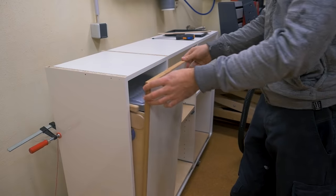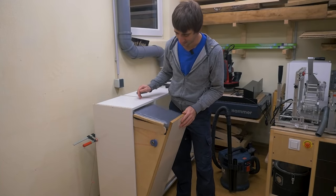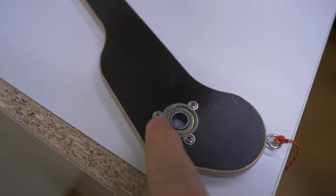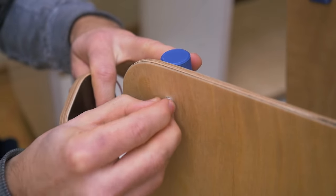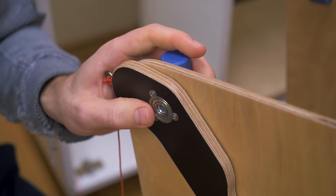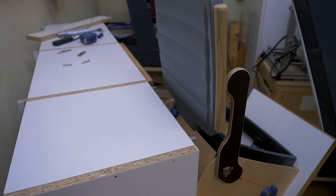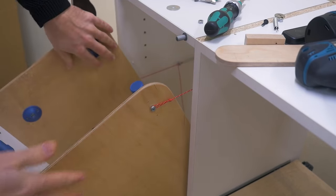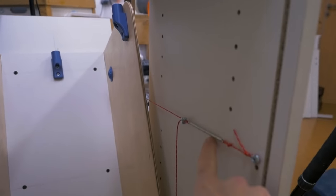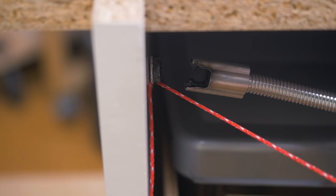This is so cool — the best part is that this mechanism is visible every time you use it. Next I reinforced all the working parts so they'd last longer than a couple of video demonstrations. The bearing is held in place by three screws. Instead of a cut-off drywall screw, there's now a short piece of aluminum tubing going into an 8 millimeter hole in the thin wood. With a spacer the bearing fits on that and is held in place by an M5 countersink bolt to keep it low profile. I slightly changed the geometry of the lever arm, added a second string on the other side to hold the weight when fully open, added a spring, and two furniture dampeners in the edge for a soft-close effect.